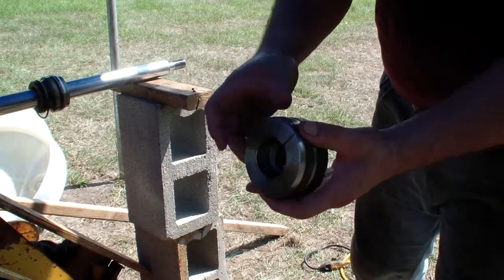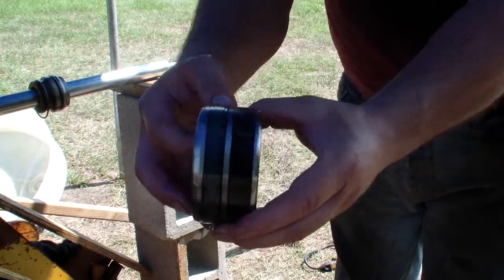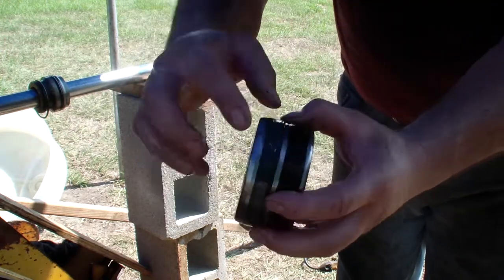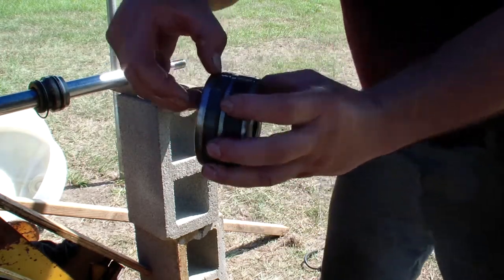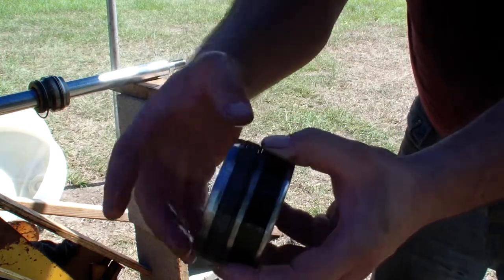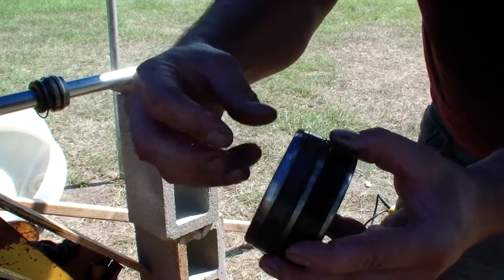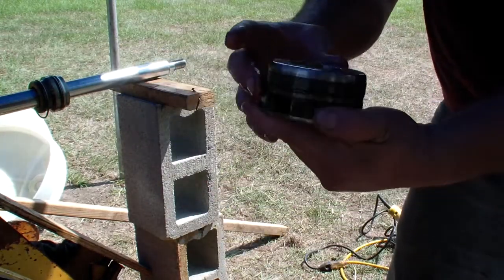It has a register that goes toward the rod and a smooth side. This over here, it's a Teflon ring, and there are two other types of material. This over here, the new one, you have to heat in hot oil. You have to soak it a little bit in hot oil, so it will go in and then it will shrink when it's cooled down. It will get damaged. It will stretch if you just try to push it as is.